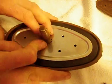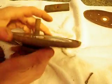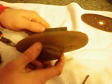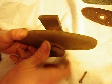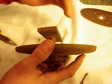So once I get that cotter pin slid through, I'm going to bend the ears over so that now it rotates as needed, and I'll replace the nut. With that, my cap is complete. So as this attaches to the tractor, as I thread my handle, you see my nut rotates 90 degrees.